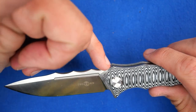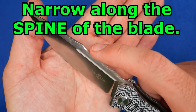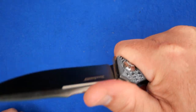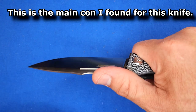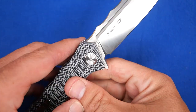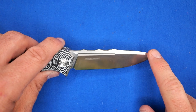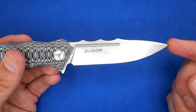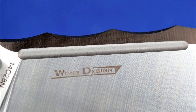It goes along the blade for three steps right there, along with swedges. It's fairly narrow along the tip of the blade. One of the cons on this knife — if you want a knife that you're going to use for doing hard work and push hard with your thumb, that's not very comfortable. The blade shape has a slight drop point. There's a swedge that goes all the way along the end of the blade, as well as an extra little one on those scooped sections. It is a flat grind, and we've got a fuller in here that's about halfway along on both sides.